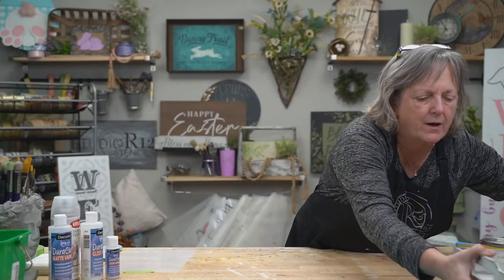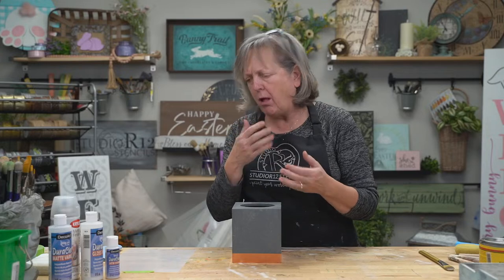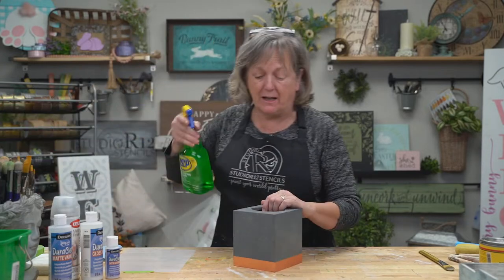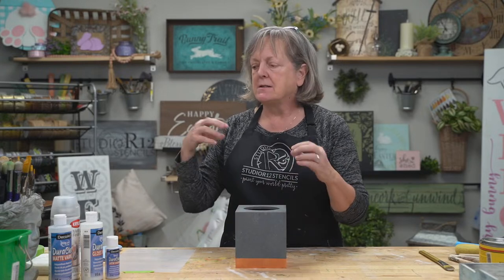And I do have one more, and it's kind of in the same line. You've got your tissue box, and people are sneezing and all of that stuff. You're going to take your cleaner, or your sanitizing wipes or whatever, and clean that thing off. You're going to want that paint to stand up to that. If you use the wrong cleaner, anything with alcohol in it, it can remove that paint. So the varnish will be a barrier to removing the paint.